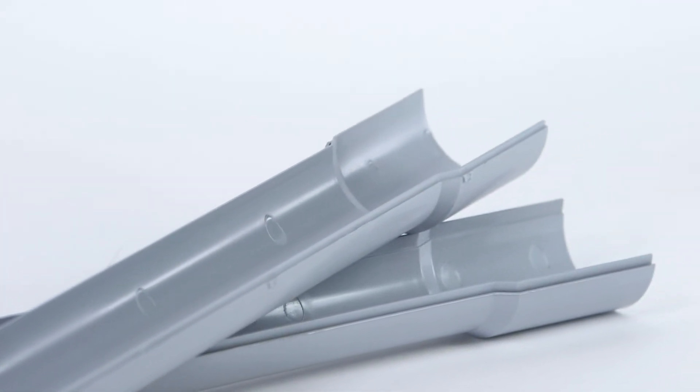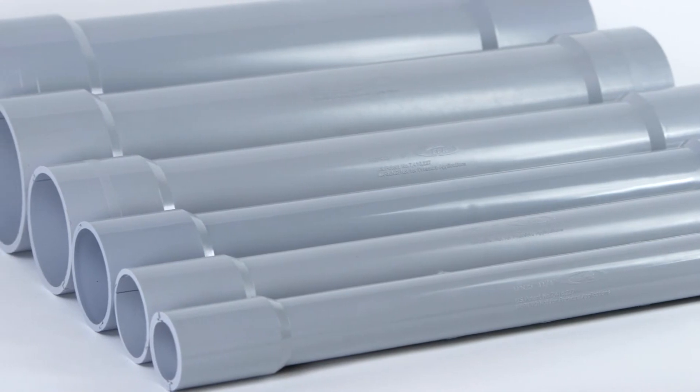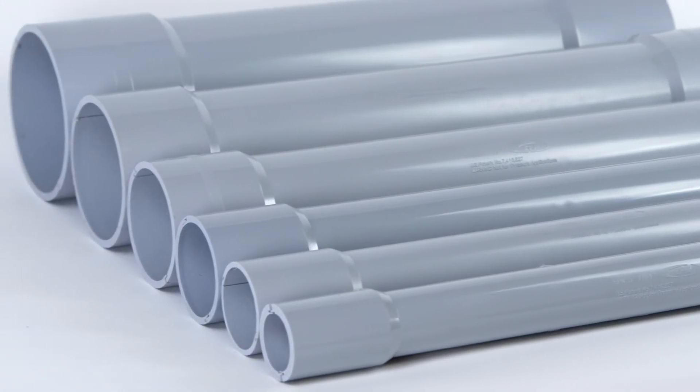EPR Conduit Repair Kits are composed of two 24-inch sections with integral coupling bells. The inside diameter of the bell equals the outside diameter of the pipe to create a bell and spigot connection. The two pieces simply close around the installed wire and cable.